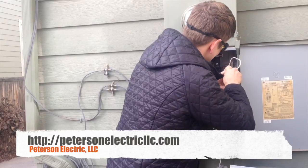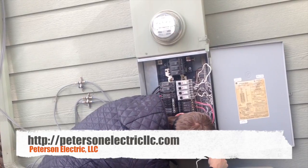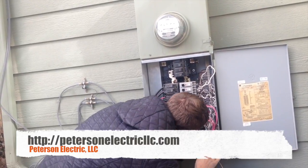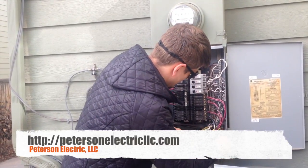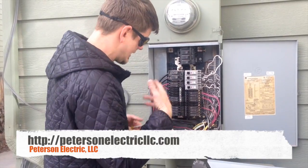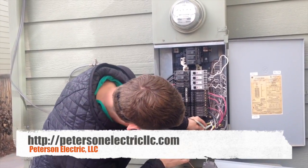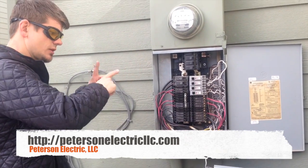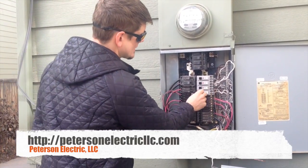I think I found it. Gently pull those wires out. I don't have any gloves on, so I do need to be careful — because if I end up having a nicked wire in there from a heavy knife when it was installed, it could just jump here and back to the cabinet and through my hands. Right here, I know that this ground and neutral is the same. I can pull it — it's off. Let's see if that neutral is completely floating now. If there's two circuits tied, it could be traveling the path of the other neutral and the other wire too. But first we're going to test it — one thing at a time.